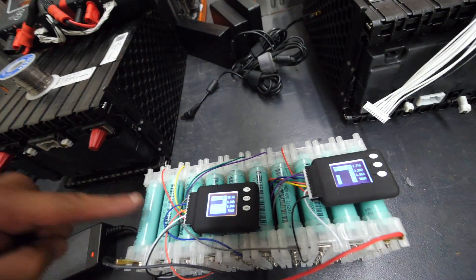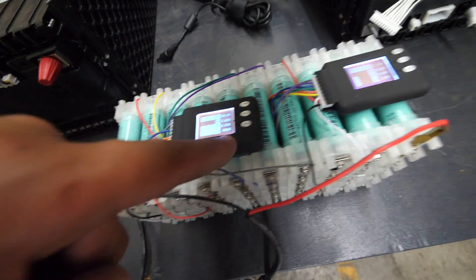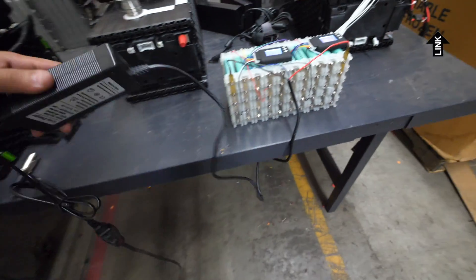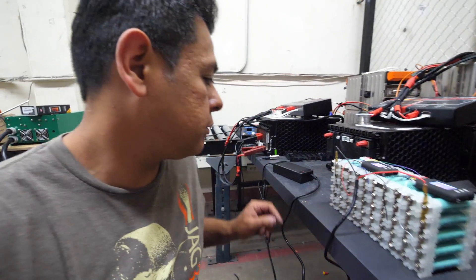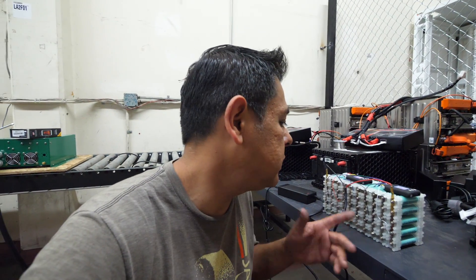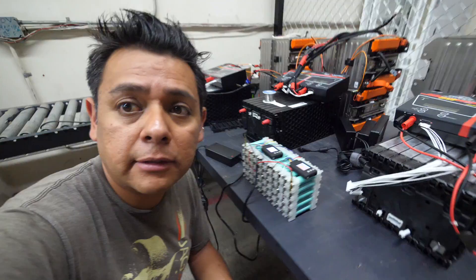Here's what we got. I just plugged in the two balance leads — here's the voltage, there's a delta of 40–43 millivolts, 20 millivolts. I've got a cheap 42-volt e-bike charger from eBay and I'm just charging this battery right now. Unfortunately I forgot the BMS boards that I have at home. I want to install those so you can charge it with this cheapy 2-amp 42-volt e-bike charger. We could probably put up to three of those units in here so you can charge and discharge it safely.